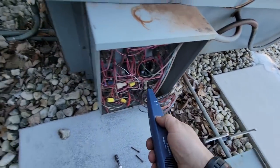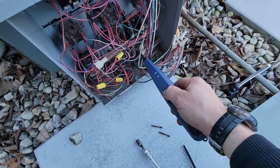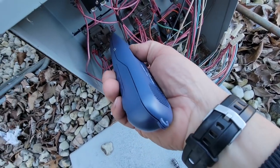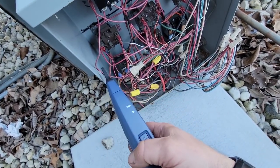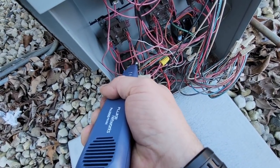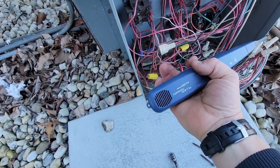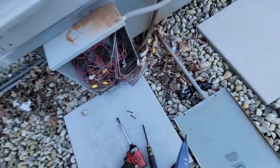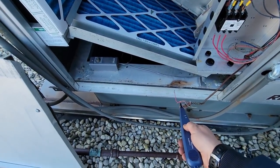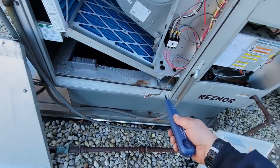Bingo — right there is the white wire that we had down there on the wall. That's powering the coil on that relay. Then that comes to this low-voltage-looking wire which then travels up to here. It's isolated, so obviously it's not going through. I'm surprised we're even getting bleed-through — it shouldn't be. But it's practically done; all they had to do is hook the sucker up.